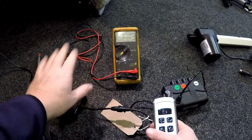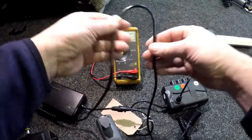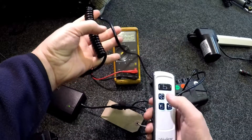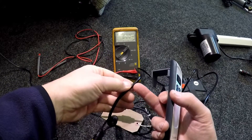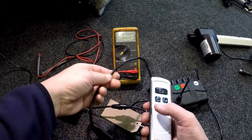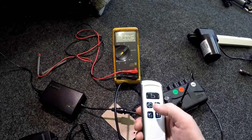I always recommend you check all the wires and all the connections and make sure everything's connected — moving the wires as you press the button at the same time, just in case there's a slack connection. If you've checked all the wires and extension cables, because these are routed around the linkages, move all the wires while pressing the buttons. You'll find very quickly if there's an intermittent fault. You can't open the sheath to look at the individual strands — this particular one is an eight-pin DIN so there are eight wires, quite fine, and there may be a slight fracture inside.